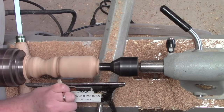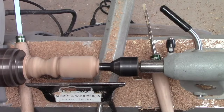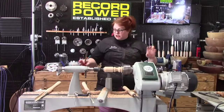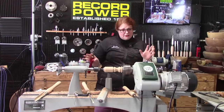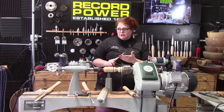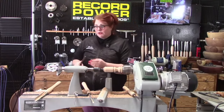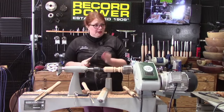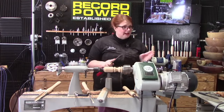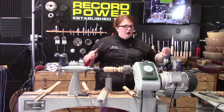And when you receive a captive ring tool, often the manufacturers include a little packet explaining how to make one. I read that backwards and forwards and upside down, and they tell you you should be turning it between 500 and 600 RPMs. And you should make sure that your tool is sharp, and you should go slow, and you should rough out your captive, your bead first. You need to lay out your bead, and you should have this much space between, and gives you all the list of things to do. No, we don't need to do that.